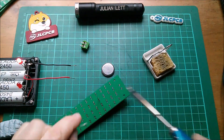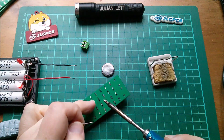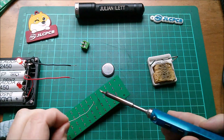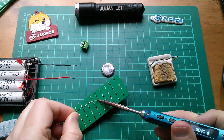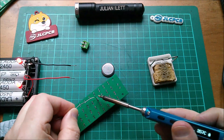I narrowed the spokes down a little bit and I increased the clearance between the copper plane and the actual pad or through-hole, so hopefully it won't absorb too much heat. But let's find out. Not too bad!